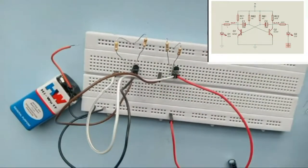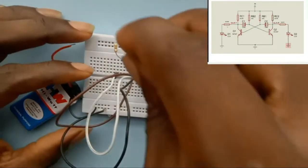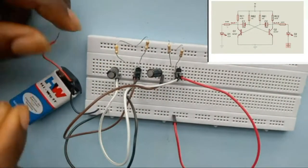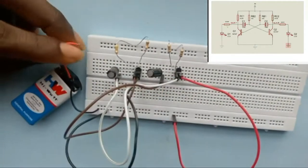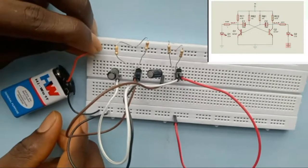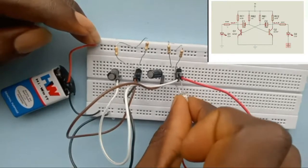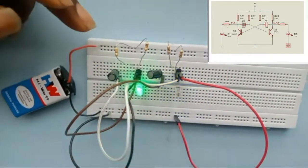Let me put back the 100 microfarad capacitors so it continues to blink at a visible rate. I used 10 kilohm base resistors and 100 microfarad capacitors, which gives me a time constant of about 0.69 seconds. So this LED is changing state every 0.69 seconds — that's about 69% of a second. My aim was to achieve roughly one second, but with the capacitor and resistance values I have, I calculated 0.69 seconds.